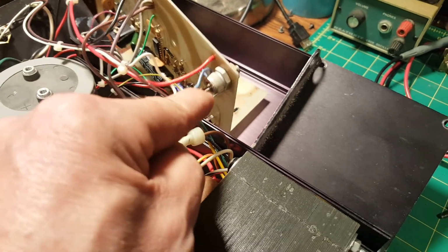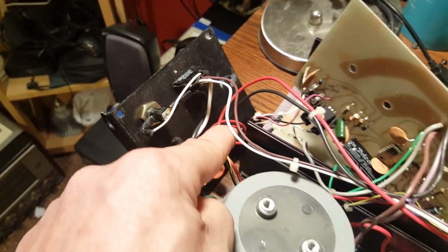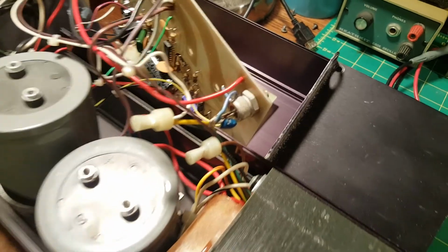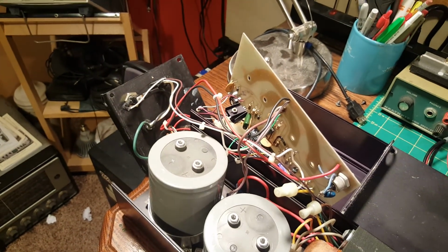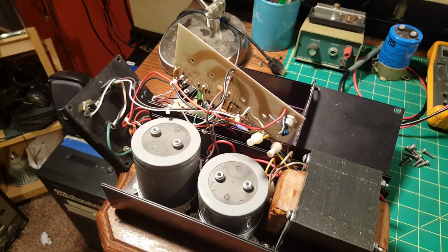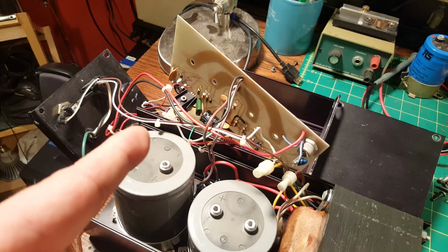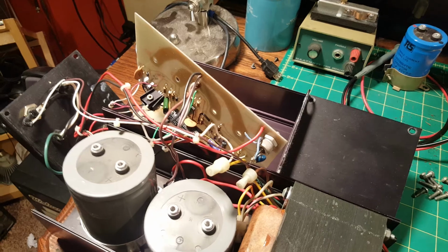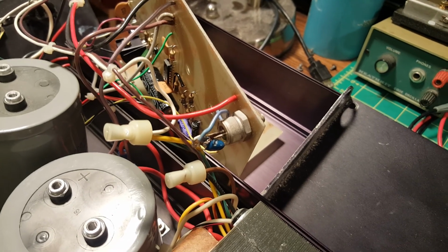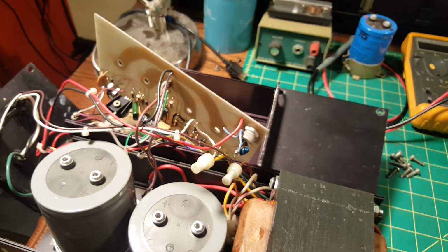And then I start looking at it and tracing the wires back. And you know what they're doing? They come back to the fuse socket and the fuse connector, and that's a triac. When that triac triggers, they're shorting it right at the fuse, right at the AC input. On one hand, it's going to draw a lot less current in the triac circuit because it's at 120 volts. It's only got to flow a few amps to blow the main fuse. When you're using an SCR mounted on the output in true crowbar fashion, that thing's got to flow tens and tens and tens of amps. The instantaneous current flow will be hundreds of amps, but the supply quickly blows.